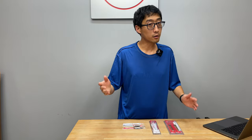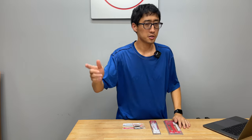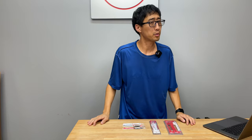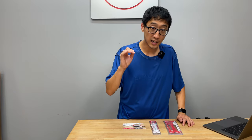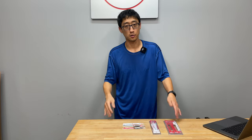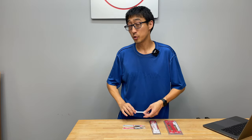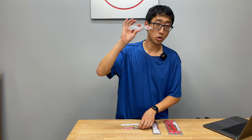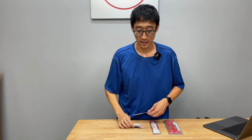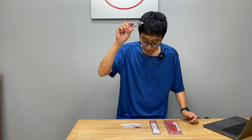And as we mentioned in this series already, we're going to be skipping all the easy stuff, right? Almost all the metal reciprocating saw blades, even bimetal, are going to be able to cut EMT, conduit, unistrut, basic screws, lag bolts, stuff like that pretty easily. We're skipping directly to the hard stuff. We're gonna be trying to cut three cuts in leaf spring or spring steel that came off an F-150, at least three times with this bimetal reciprocating saw blade, then with this Torch carbide tipped reciprocating saw blade, then we're gonna add NOS to it and use this nitrous carbide reciprocating saw blade, right?